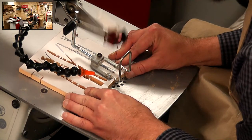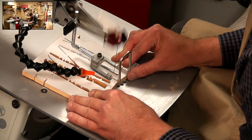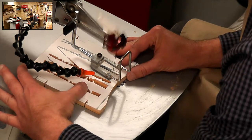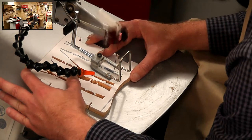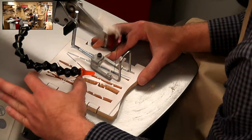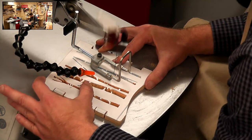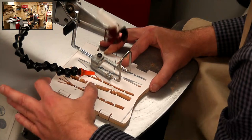So cutting off that round bit where we drilled disguises that a bit. Again, every now and then you'll get a little bit of timber that falls down in the extraction and acts like a little pin. You can't move your workpiece. Sometimes you'll have to stop the machine and go fishing for it. But quite often you can flick it back out with a blade.